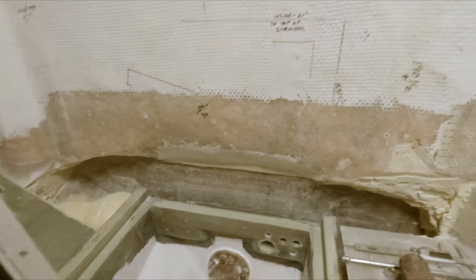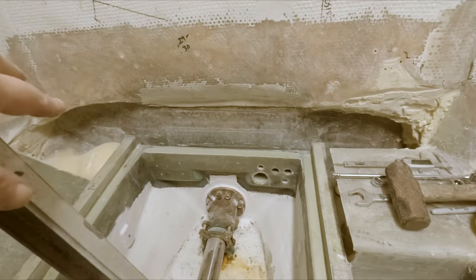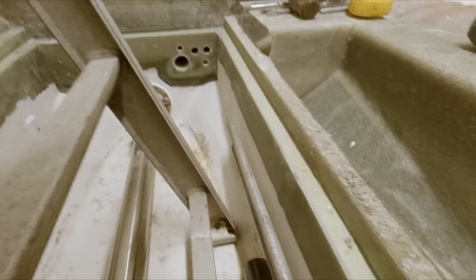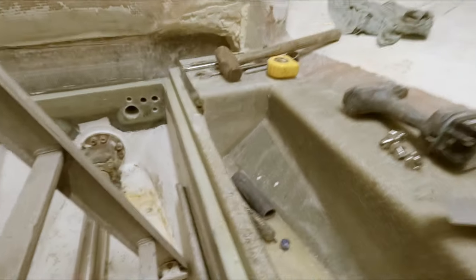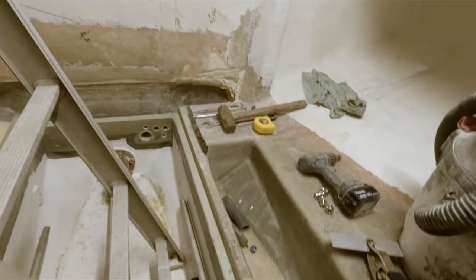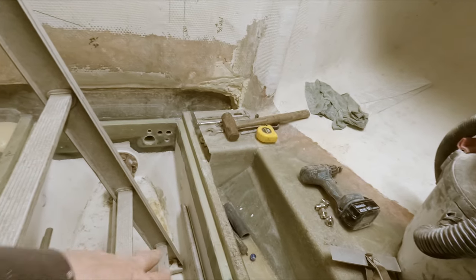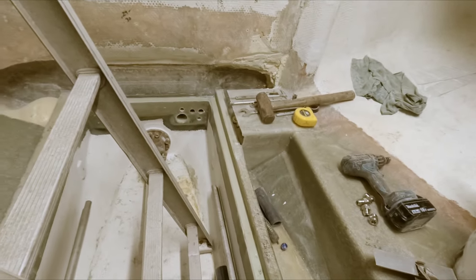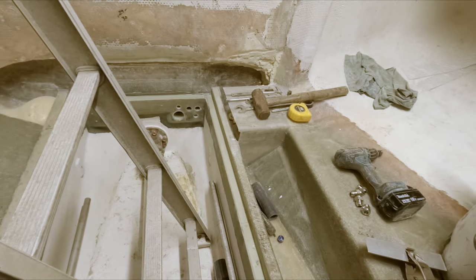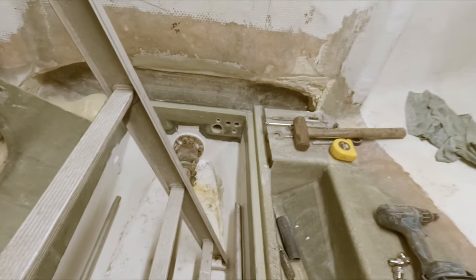Yeah, so we got our holes bored in there the other day. So that's where the one set will go, the other side over there. So the issue is that these pipes are lower than where they go through the bulkhead. So we need to have a little bend in our tubing. And that's why we ran this in with pipe right here and then just tubing for the rest. The pipe is a little more economical than tubing. For this run, it just made sense.